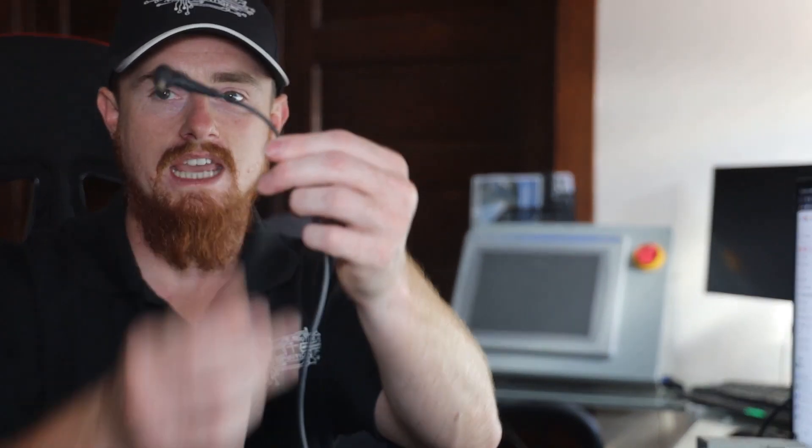I didn't really explain this part on the other device we have here, but this is the end that you'll have on it — something similar to this. You could have anything depending on what you're taking this power supply from, but essentially what you need to do — while this thing's not plugged into the wall — is chop the end off. For the most part, you'll generally only have two wires inside of here, and you just need to test which is the positive and which is the negative of those two wires.